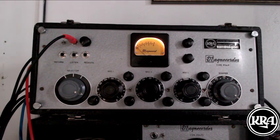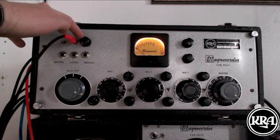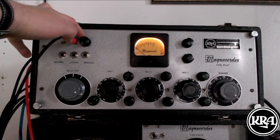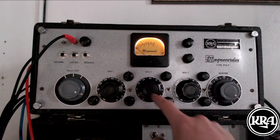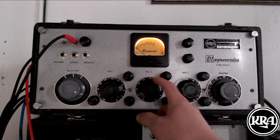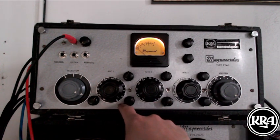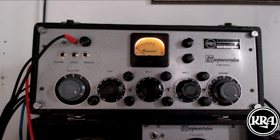Now, when I started the video, I had some theme music playing from my SP404. I've got it hooked up to come into the line level input up here. Well, let me talk about these inputs before, I'm getting ahead of myself, right? So I'm talking about the effects send. Each of the channels has an opportunity to add to the effects mix, which goes through a 12AX7 triode tube stage and gets amplified.